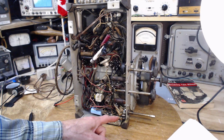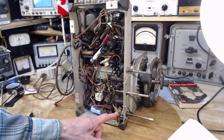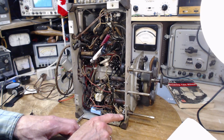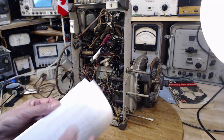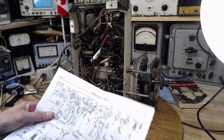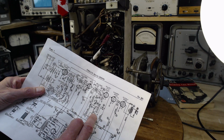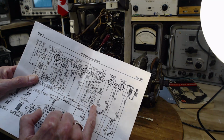And the very first one I want to pick is the one that conveys the volume over to the first amplifier tube. So it's going to be this one. I'm just curious, there's a wire here too. It's got a wire and a capacitor. Why does it have a wire and a capacitor? How does that work? So we have the volume control here, it comes off through a capacitor, then encounters the grid and more stuff.